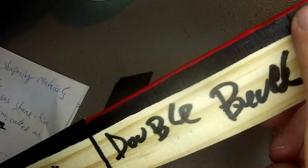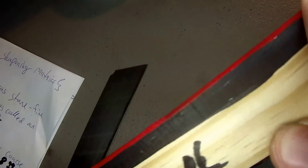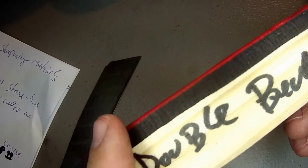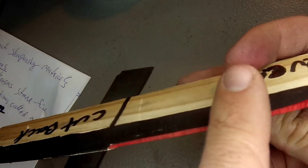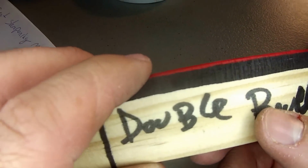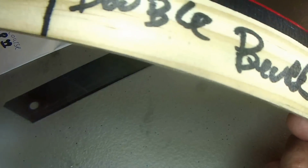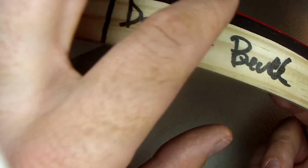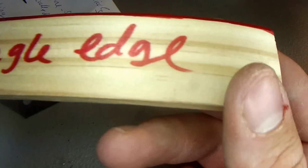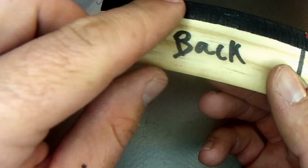This has the main back cut with about a 13 to 15 degree angle. And then we come back and we put that 20 to 25 degree. We could even go 30 degree, whatever you like for this main edge here. And that's really going to give this the strength and rigidity to hold up to the abuse. And then when we come back in and sharpen this again, we're not going to have this giant thickness right here to deal with. We're going to be right back to getting on that edge and polishing it.